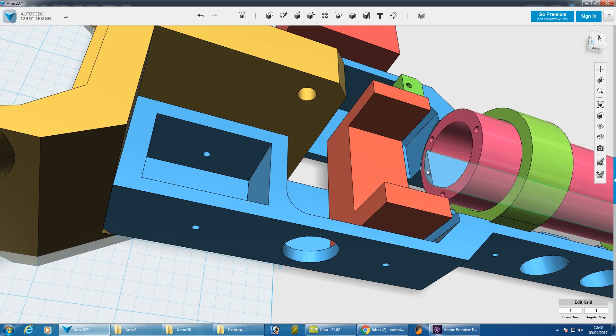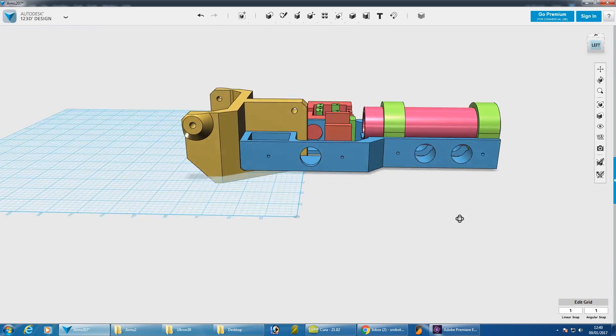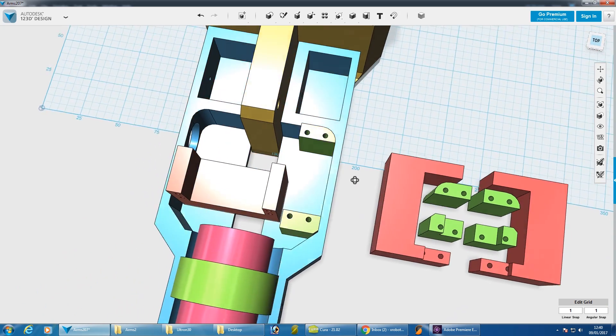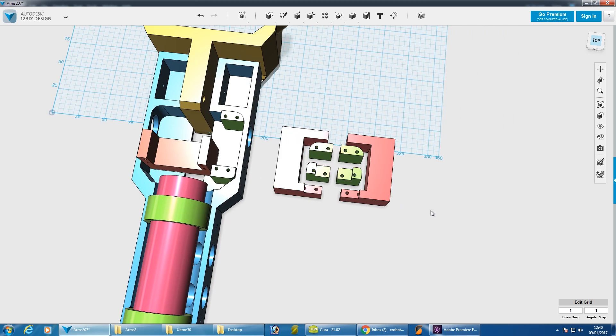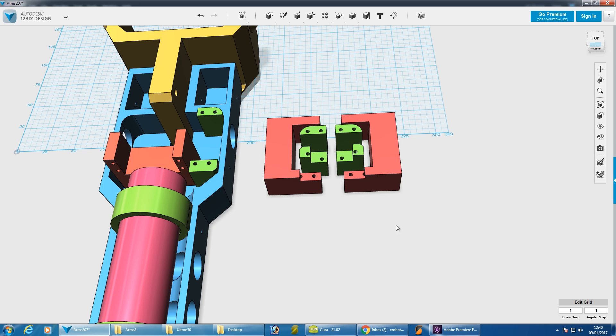We're going to make some brackets to fit those first — that's most of the heavy weight because they're metal gear servos — and then we can come back to the bicep to lift the whole arm. Here are my servos: a combination of 9 and 15 kilogram-centimeter servos with metal gears. We've got three 15s and one 9 — the 9 for rotating the wrist and the 15s for pulling the fingers. I've designed some simple servo brackets, this red one here, with the servo center aligned, to be solvent welded in.